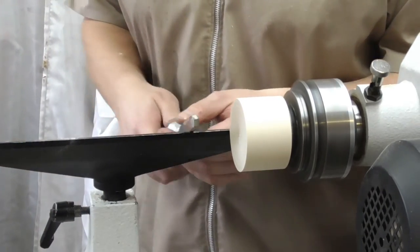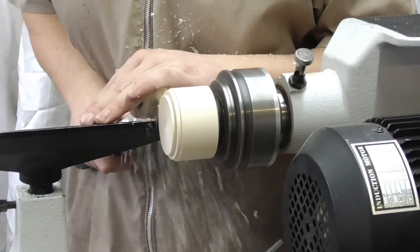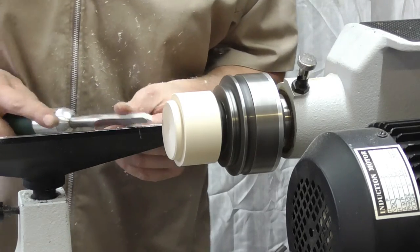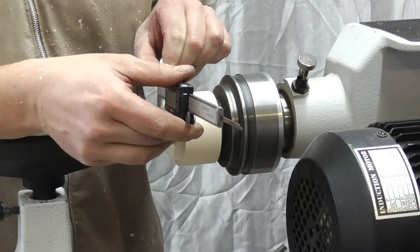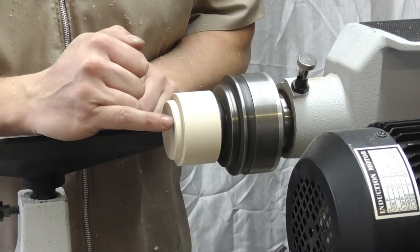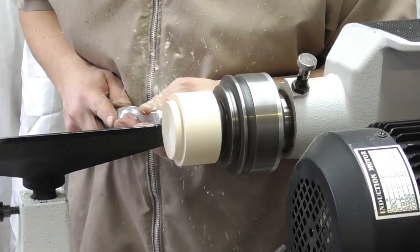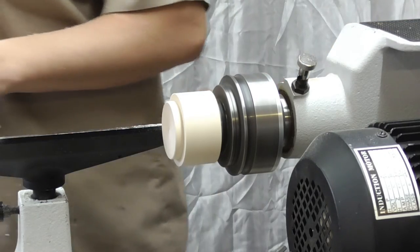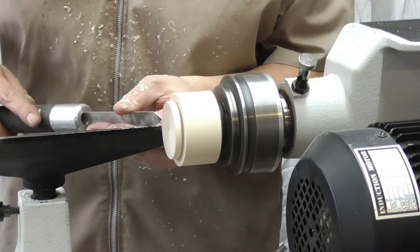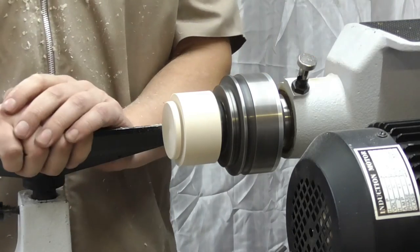I'm going to go in with a parting tool. A little trick I do is put a little chamfer on the front edge and then run the verniers back on that chamfer — what that does is centralise and give you a final marking, which is just like a fine tuning trick so you can see exactly where to go to. You do need a groove at the back, so I'm going to use my thin parting tool, make sure there's a little chamfer at the front, take the sharp edge off the back, and that's now set.